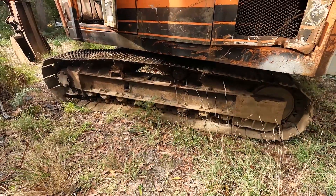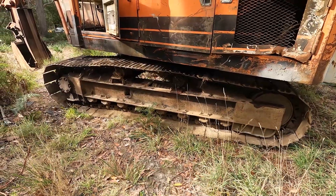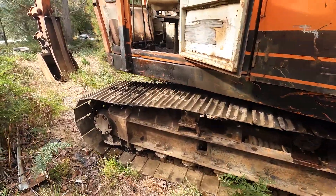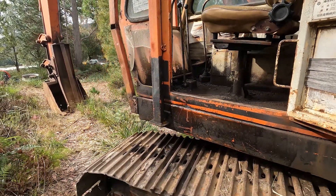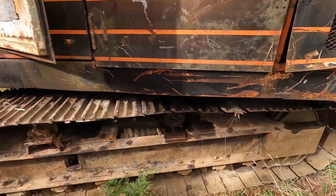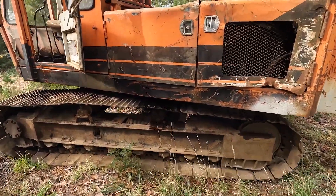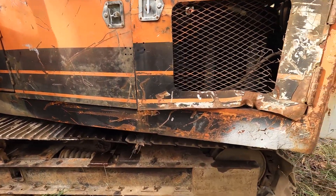The truck driver delivered it the other day. As you can see, he had a bit of trouble getting it off the truck — that happened before we arrived to give him a hand. I think he just wasn't familiar with the machine. Apparently when you go to track forward with both levers, it doesn't actually put power to both sides — it pretty much just put it to one side. So it swung around on him and slipped off the side. It was no big deal, but it was low on hydraulic fluid, so he had trouble getting it back off. We ended up putting some more hydraulic oil in there just to get it to move again.